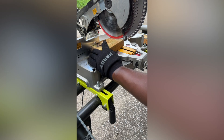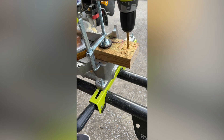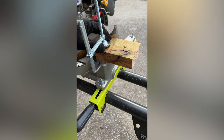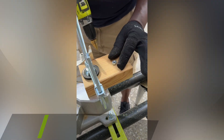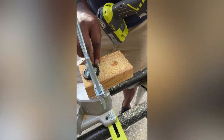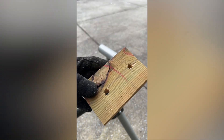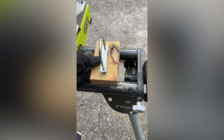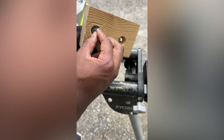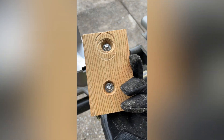This part may be optional for most depending on your setup, but to create my support bracket I used a scrap piece of wood that would serve two purposes. After cutting the wood to size I drilled two holes to support a large U-bolt, then enlarged the holes on the back side using a step bit, which would give me access to insert and tighten the nuts for the U-bolt. Before inserting the U-bolt into the wood I made sure two nuts were present on both sides of the bolt. Once the U-bolt was inserted I installed a washer on both sides of the bolt followed by the nuts. It was also important that the bolt did not protrude from the back of the piece of wood since the wood needed to mount flush against my wooden fence.